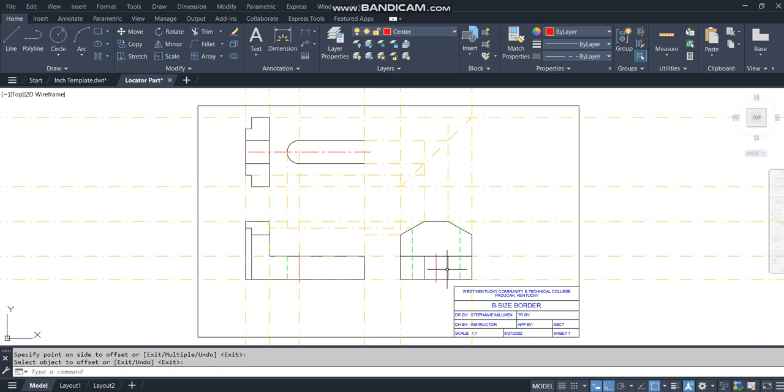The last thing on the top view is locating where these cutouts go. So they say that they're 1.75 from the end. So from this end over, I'm just going to go ahead and use that as my offset. It also means that in the front view I can see those, so they should be a visible line. From the side, it's offset 0.25. So I can go ahead and offset both of these and trim those up 0.25. In the top view, same thing, it's going to be 0.25 where it starts.